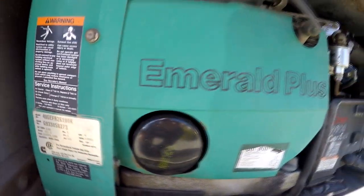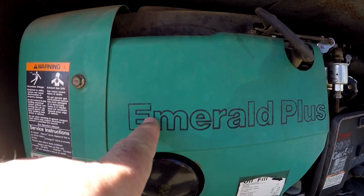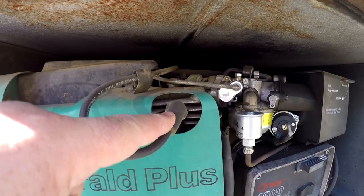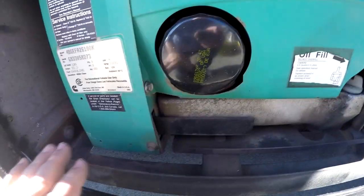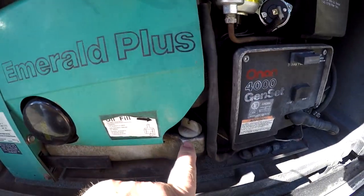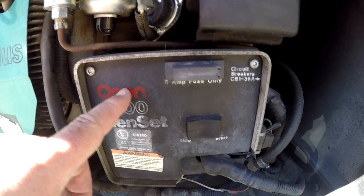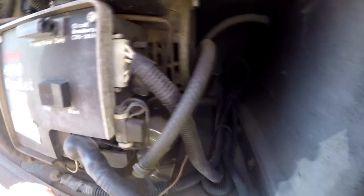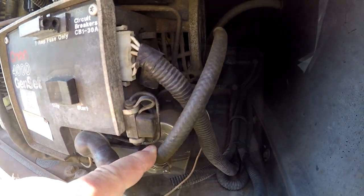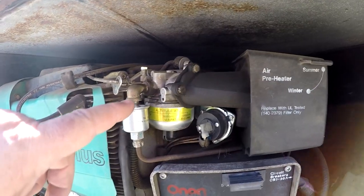What we're going to be doing today is replacing the filter, replacing the oil pressure switch which is behind this part here, and replacing the two spark plugs — this one that's easiest to get to and the spark plug in the back of the unit. We'll even show you a trick to do that without having to drop the generator down. We're going to do an oil change and also replace the circuit board, the fuel filter, the fuel pump, the air filter, and actually replace the carburetor.